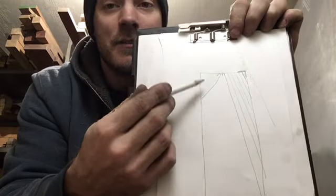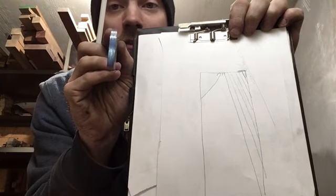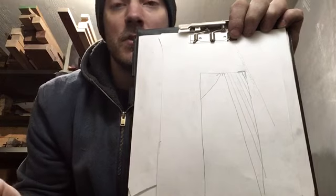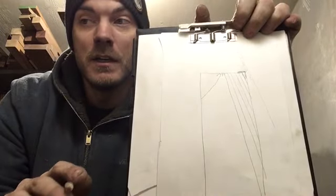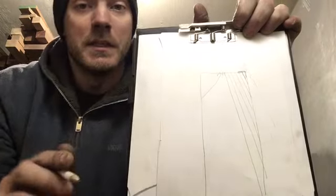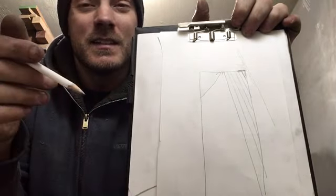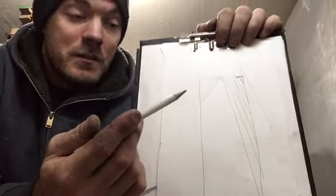Now, that obviously looks like a lot of material, but if you picture 45 degrees off the center line of that, it's really not much. So you use a worn out belt, something that's not a new belt, like a 50% worn out 60 grit, 36 grit, whatever you want to do, something that's already kind of worn, because this is going to wear that belt quite a bit. Again, you're not taking a ton off, but it's going to be hell on a brand new belt, right?